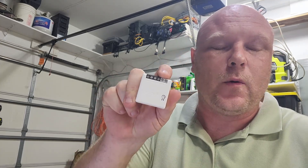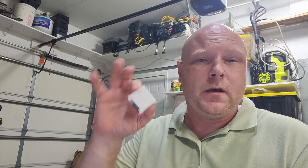Essentially, you have your line in, your line out, your load, and then neutral. It needs neutral so it can power on all the time. These little gray ones go out to a switch, which could be a light switch or whatever — you don't even have to use it. What I like about these is they can run off MQTT through Tasmota. If you've ever heard of Tasmota, if you run Home Assistant or some home automation app that uses MQTT, these are lovely.